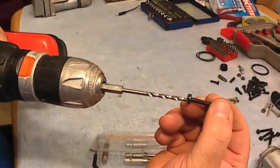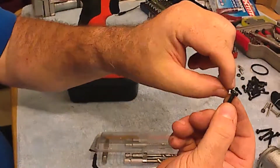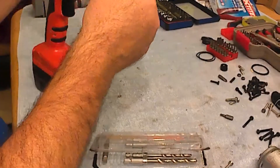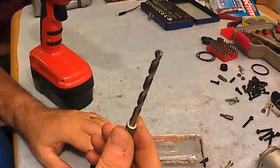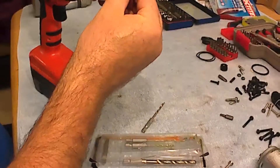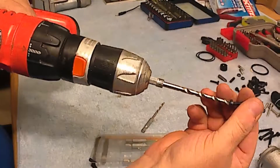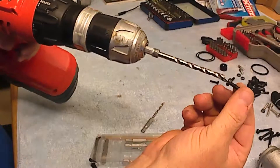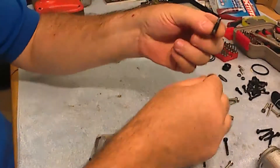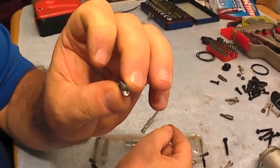At the head of the bolt, drill exactly to the depth of the head. After making that hole, replace the drill with a larger one — 3/16 inch. When you enlarge the hole you already made, you will see that at some point the head will just pop off, leaving the bolt without the head. You can see the hole inside where the head was.